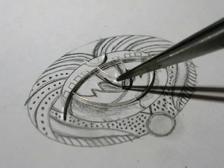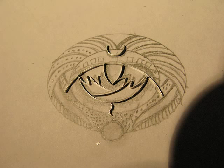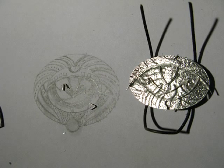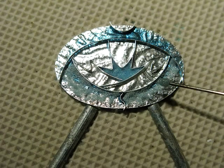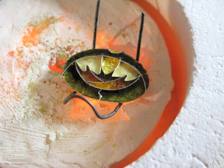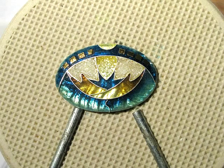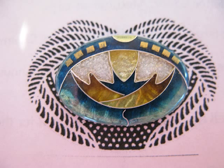Here I'm sifting on glass on the back and bending wires for the design. Now you put the wires on glass on the front and fire it on. That holds the wires fixed and you apply the wet enamels. Here I'm adding in fine silver foil, firing that in, drying and firing — and there it is finished.